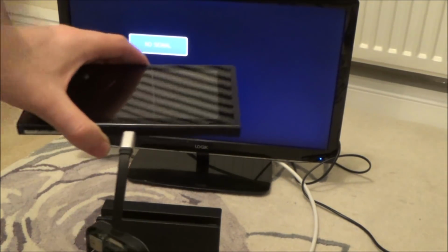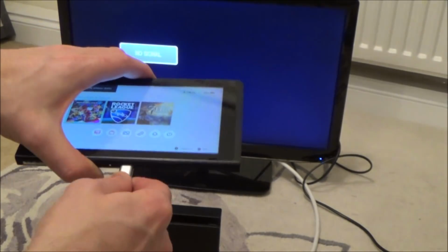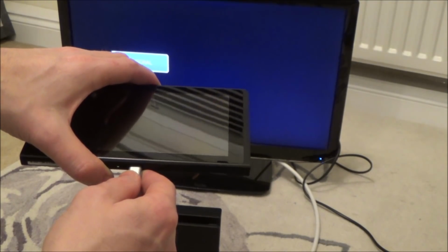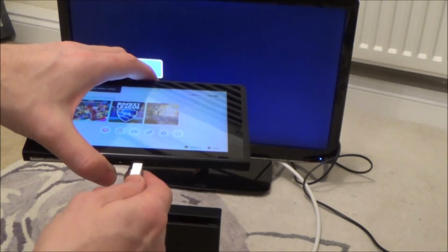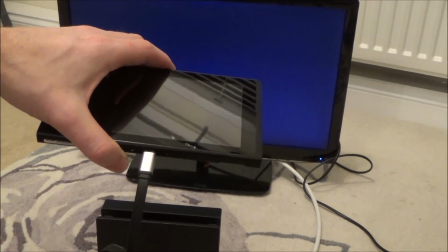So I'm pretty confident now the problem wasn't to do with the USB port. So although it's not working, at least now we've got more knowledge. Don't know what the problem is. It's probably going to be a hidden trace somewhere sandwiched in the board, you know, one of the tracks on one of the inside layers. Right, I've got one more dock to try. Definitely not a good fit though.